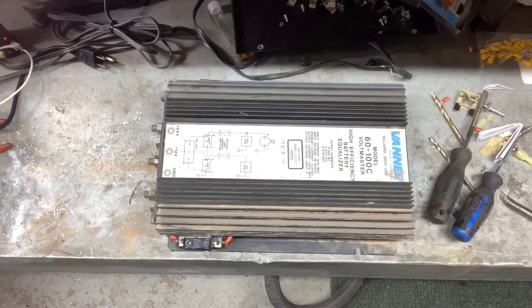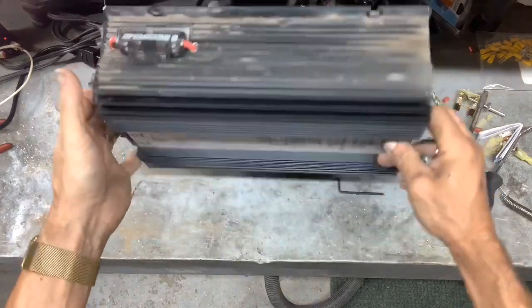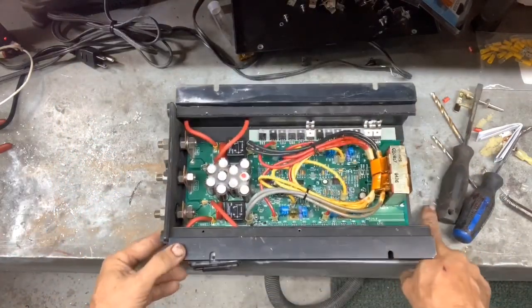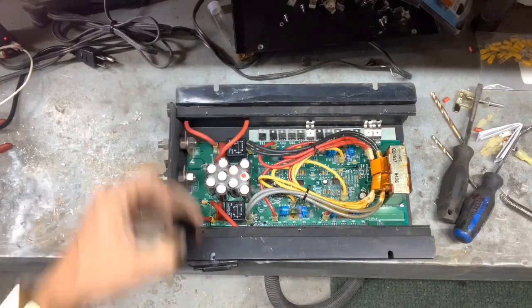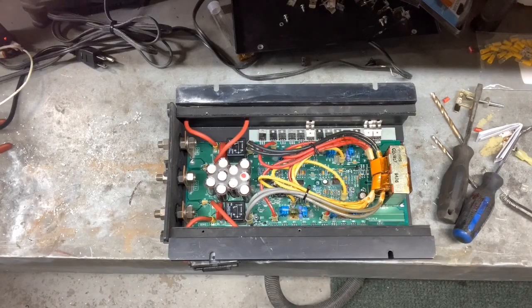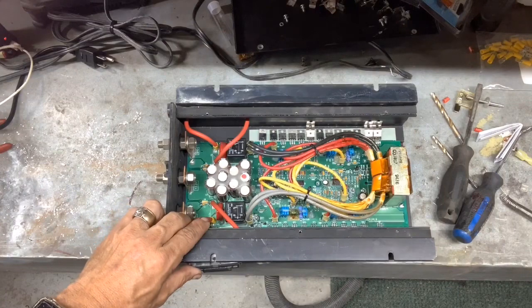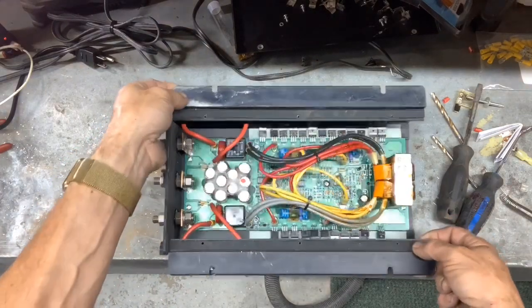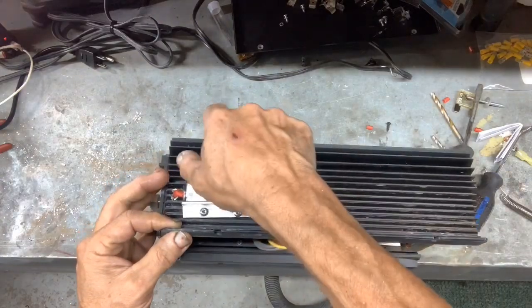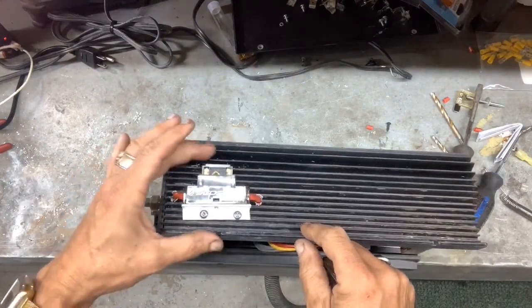When they break, it's usually just a fuse. But unfortunately, the fuse is normally soldered in to the panel here. So it's held in there and it's soldered on. You have to take the whole unit apart, you have to desolder the fuse, and do it again. I've come up with a little modification that you can do yourself that makes life a lot easier — put in some 4 gauge wire to carry the 70 amps, and install a fuse on the outside of the unit.